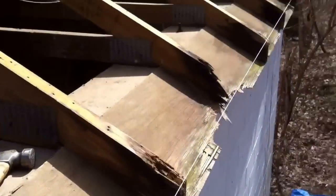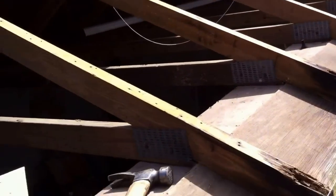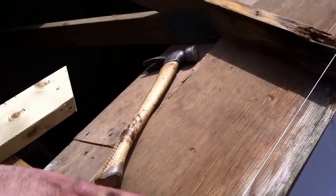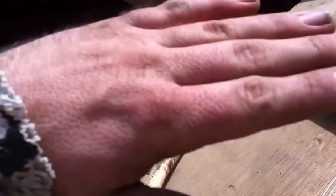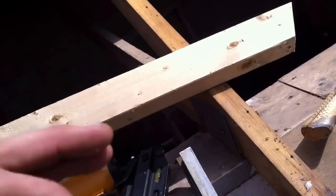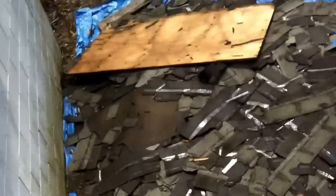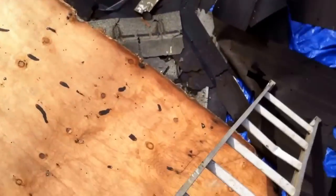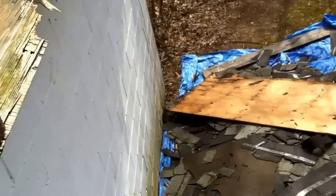The reason fascia is so important on something like this is because fascia actually lifts the edge of the plywood up and gives the edge of the plywood — the perimeter, especially near the eaves — all its strength to keep from making droops and bends. And at the lowest spot of the bend, water and capillary action will pull up and rot them out. If you look here, you'll see the end of that plywood right there, and then the edge of that one all rotten out.